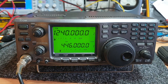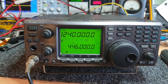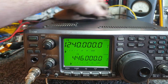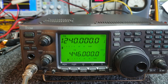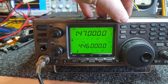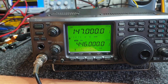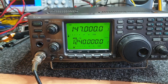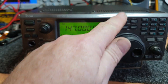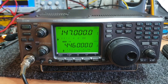Good afternoon. This is the Icom IC-910, which just came in today for a friend of mine. As you can see, it has three bands fitted to it. If you hold the band button down for a second, that gives you the two bands you're more likely to use, and you can switch between them or have both active. You can also hold it in for one second and decide which band you want in each position, bringing 1.2 GHz up to the active section. Most of what we're doing today is just on two meters.